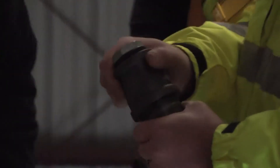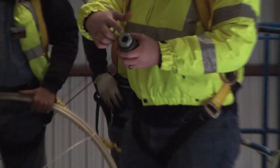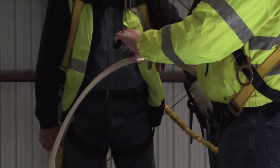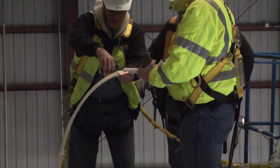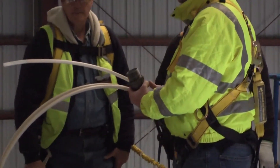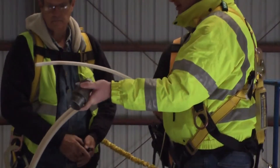They made this reducer device here. It screws into one of the bungs on the tank and gives the ability to support the probe. As we mentioned, you can see it has a three-quarter inch opening. This is going to slide on the probe from the bottom where you cut the wrap — it slides on upside down. You're going to slide it on all the way as you're putting the probe into the tank. Cut only the first wire tie in order to assemble the hardware on the end of the probe. Make sure you slide the fitting on so it ends up right side up.